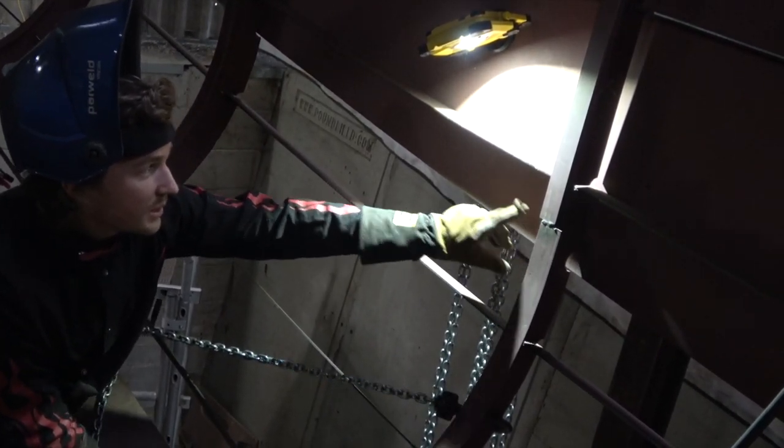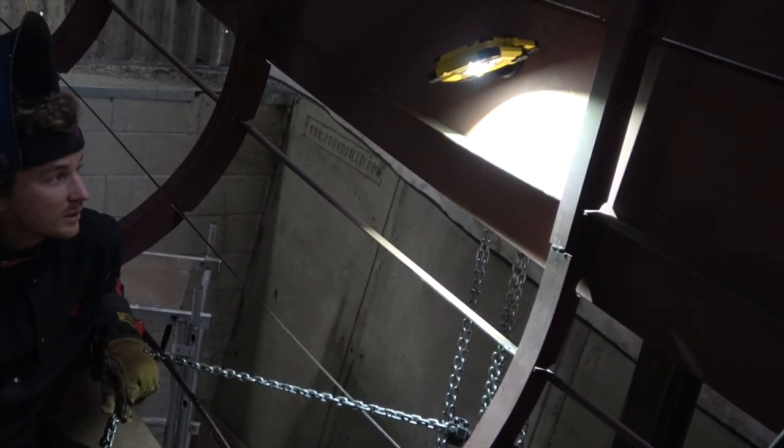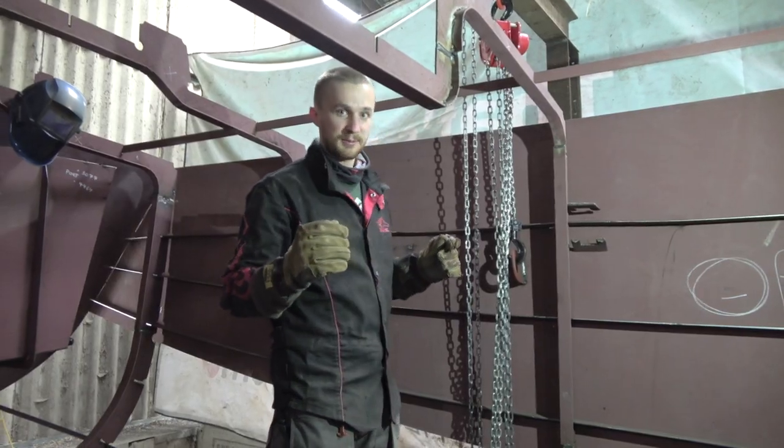Firstly, with that, we made as many observations as possible. So with the frames looking like they were higher, we decided to measure those frames. We went back to the drawings and checked all the dimensions and measured as many as we could, and they all seemed to be exactly right. So the next stage was thinking that maybe the transom and that bulkhead weren't square, weren't parallel to each other, or maybe weren't square to the center line.